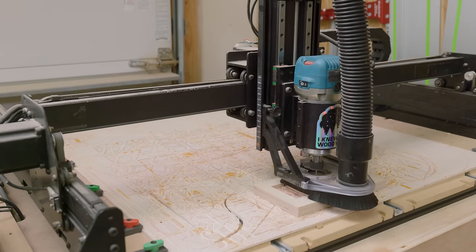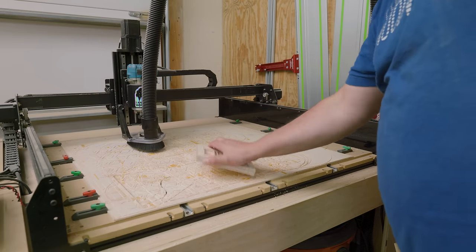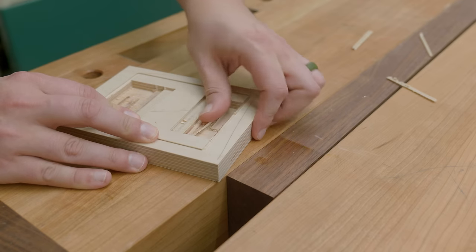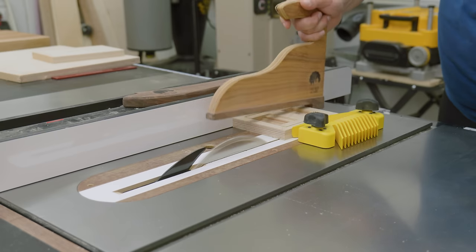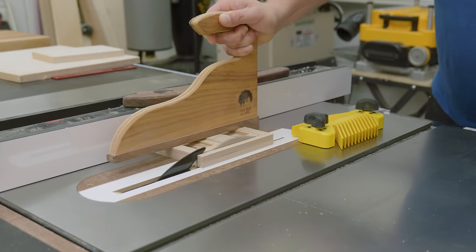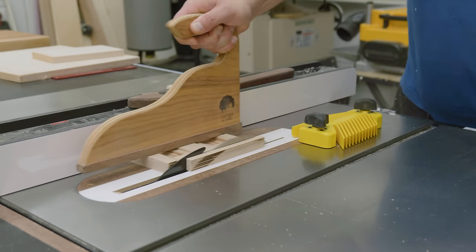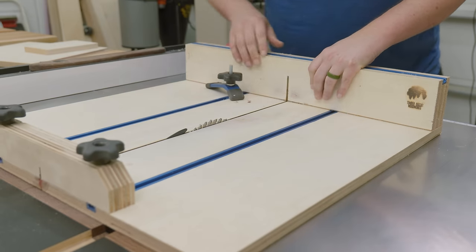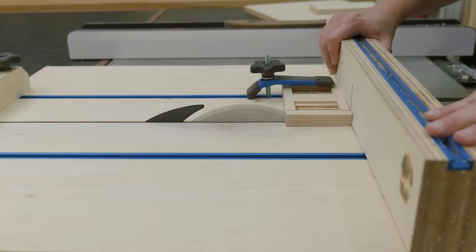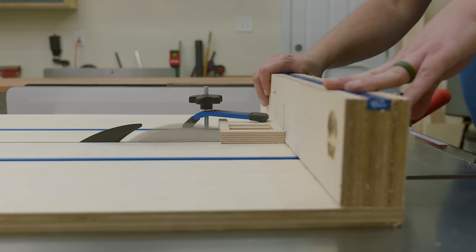I should clarify that this is specifically designed for the side clamping honing guide by Veritas, but I will test it on an Amazon one later in the video. Right off the CNC, this thing is going to require some TLC. The next step is to bring it back over to the table saw and trim it down to its final dimension. I chose not to carve it completely at the CNC because that's pretty time consuming — the table saw was just a more efficient and practical way to go. What I did do on the CNC was give myself some guidelines to reference against for my cuts, which made trimming the block out super easy.